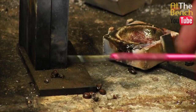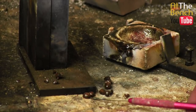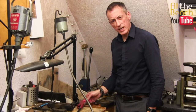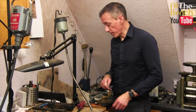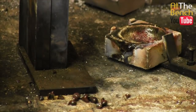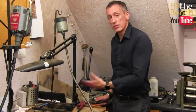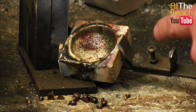These little bits that you've got now down here, as you can see, they have come off that metal bit nice and easily. These couple of bits down here got stuck, but there we go. So what I would do is not even throw those little bits away. I would put them into perhaps my sweeps jar, because there could be some little bits of gold, some little bits of silver in that little bit of borax that's come out. But as you can see, there's a lot of borax there that was coating that crucible. And the crucible is still fine. You've still got a coating of flux on that crucible, so you don't have to re-season that crucible again. And that crucible is ready to live for another day.